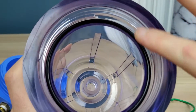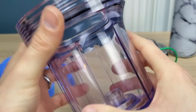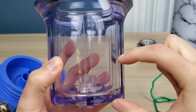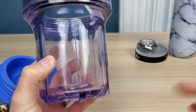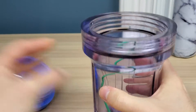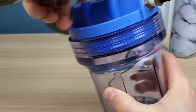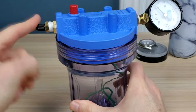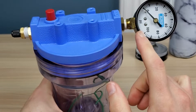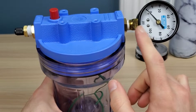There's a rubber gasket — you want to lubricate that with silicone grease and make sure it doesn't dry out. What you do is fill the water up to here, and then your watch is going to be hanging up here, not inside the water. Then you close it up nice and tight, open the valve, and start pumping air in until you reach the maximum or whatever pressure you want. So this right here will test for about 60 to 80 meters, depending how much you push in.